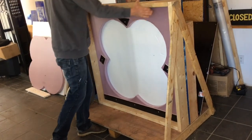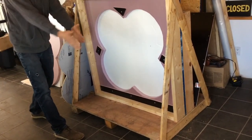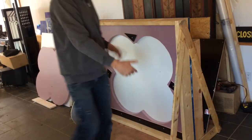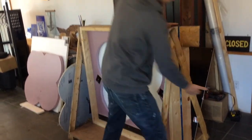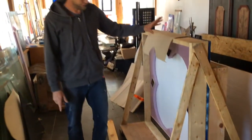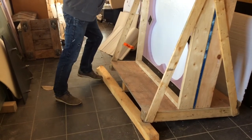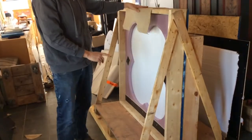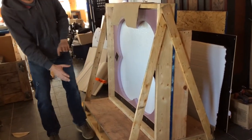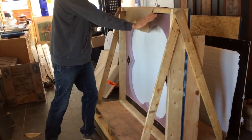What we always do is when you're working on this box, we lift it up on one side and put a 2x4 or 4x4 — depending on how big the skid is — underneath, and it will lean the box this way. When this box is finished and sealed off, then we can work on the next box and only then. Then we put the 4x4 on this side, lift it this way, and put the panels in on this side. Here is my 4x4 — I tilt the box up and put the 4x4 underneath. This is important for unboxing as well, because if you open up the box and all the panels fall towards you, that's not a good scene. So always, on the side you're working on, put a 4x4 underneath, tilt it back, and now when you put the panel in, it will fall in and cannot fall back out.